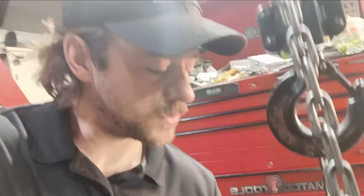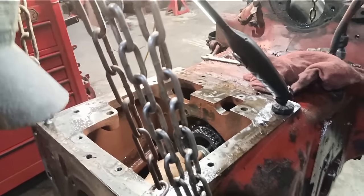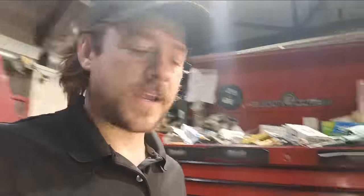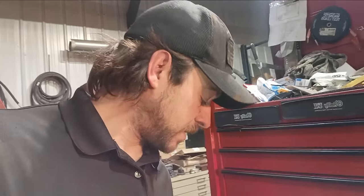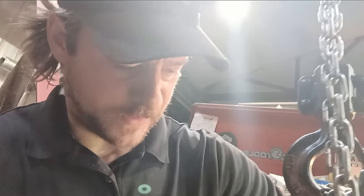One thing a guy can do if he so wishes is to take a bolt and a couple of very big washers and thread them into the back of the TA shaft. That'll keep the quill housing and the TA all together. It really doesn't matter when you're taking it apart, because it all has to come apart anyway, but it just makes you not feel like as much of a moron when everything falls apart onto the floor.